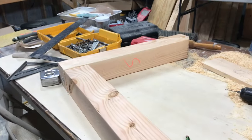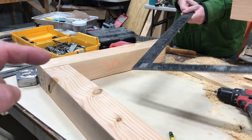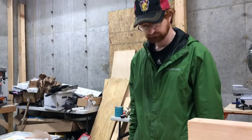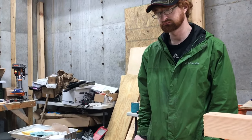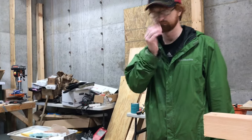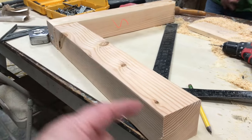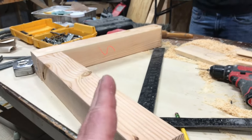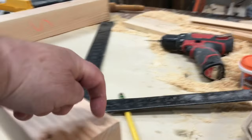We're trying to keep it simple, so Barrett, grab the framing square. We're making that top piece 23 and a half so it stops behind the fascia board on top of the sheeting. If Paco frames the rafter hanging over 24 inches, then he's going to add OSB - the sheeting - so that's 23 and a half. I'm going to leave this one on 24 because that'll give it an asymmetrical look. I don't like these brackets to be too symmetrical.